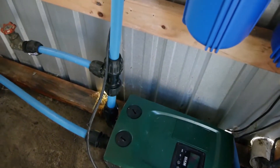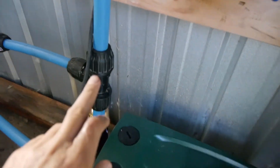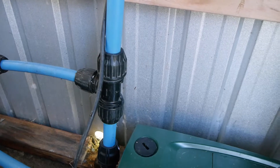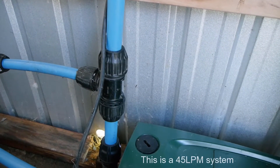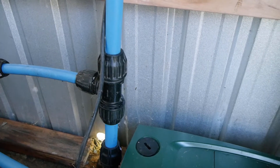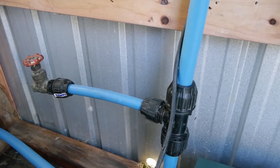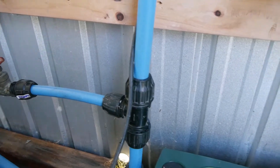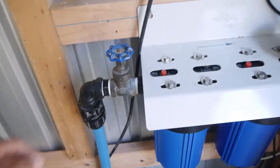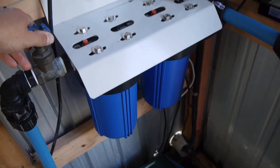From the pump we're running the same diameter piping, using these fittings here. There are heaps of different ways and systems you can use — we primarily ended up using these because we had heaps lying around, trying to keep it inexpensive. We've got a little drain-off tap here for when we need to do maintenance on this side of the system, and then up here we've got a tap valve so you can isolate these filters to some extent.